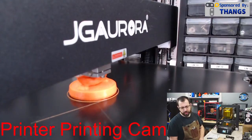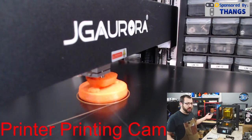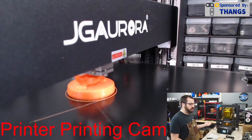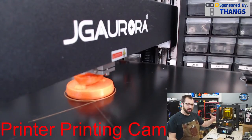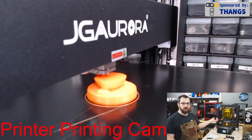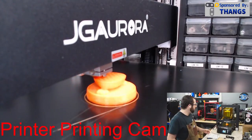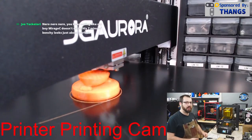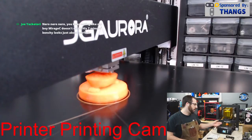First printers were not quality demons. Printers are getting there. CNC machines have been doing this kind of stuff since forever. And now we have stuff like input shaper. CNC machines can have load sensors on them. When you're running a professional CNC machine, it can tell the load on the tool head and automatically adjust speeds and feeds to compensate. We're just now getting things like input shaper on 3D printers. We are so far behind in terms of the software support for these kinds of machines.